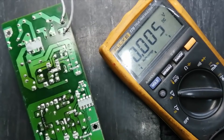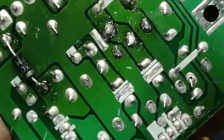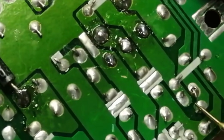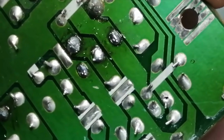We have another very small issue. I will remove power and show you the problem — we have dry soldering here, there are dry joints. We have to retouch the soldering and then we will check. Never touch any board when it is live.